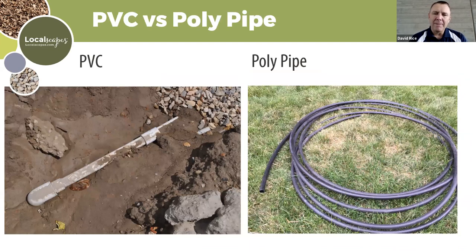PVC versus poly pipe: PVC is rigid and needs fittings — 90-degree, T-fittings, 45-degree angles — and glue anytime you need to change direction. Poly pipe is very flexible, can be taken where you need it, has no glue, and is put together with barbed fittings and clamps. Both are commonly used; sprinkler contractors have personal preferences for each.